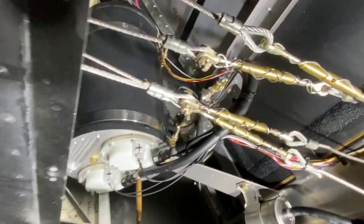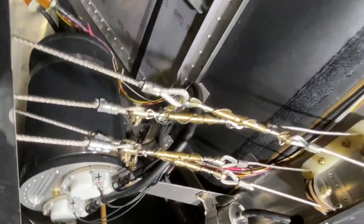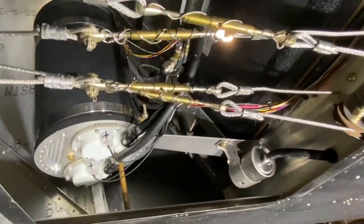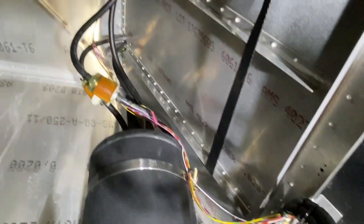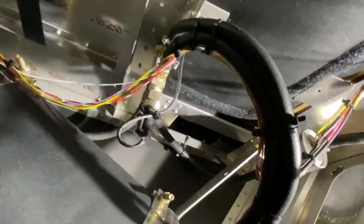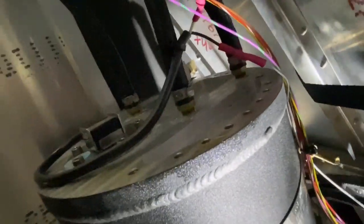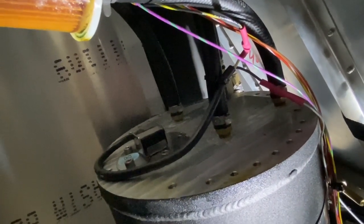As far as doing this work, you can do it at the end without the plane being partially built. Don't put the rudder cables in yet because they cut the hole in half — without rudder cables everything is easy to get to. There are four threaded fittings on top of the tank. I'd recommend viewing other videos about this as well. Here's what you've got: your fuel transducer and four hoses coming in from above — vents, feeds, one from each tank.